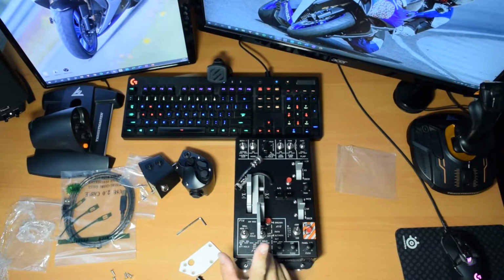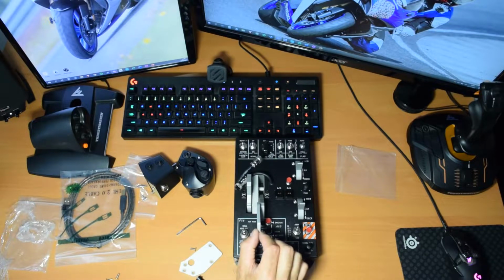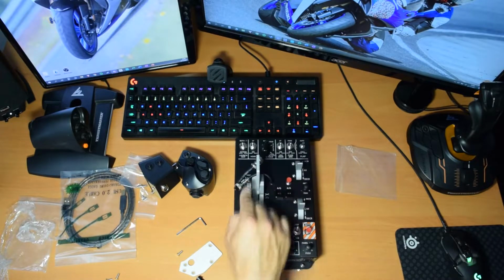Again, as a reminder, when assembling something, it's always good to set the screws without tightening them. I put them in until the countersunk portion kind of helps center the piece. Did not tighten them until the end. You also don't want to over tighten them because you're tightening into aluminum, which can strip very easily. So do not over tighten these. And now I'll do the other side.